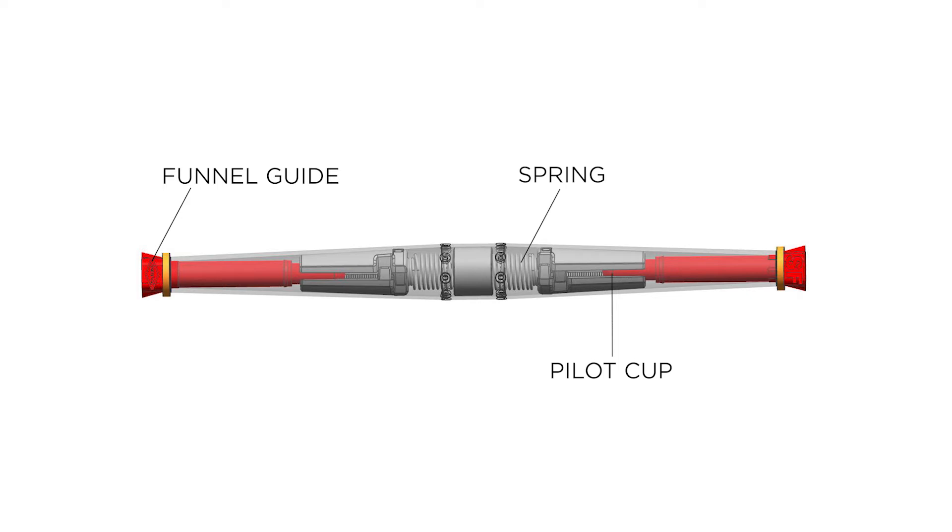The pilot cup has a hollow chamber, which allows the conductor strands to stay in place, and a solid chamber that sits within the jaws, which allows them to remain open without deforming the pilot cup. These two features make conductor insertion much smoother and installation easier, especially when using larger-sized conductors.